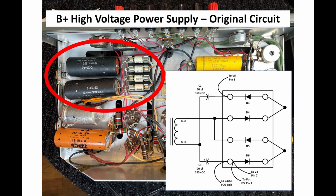just to make sure that I got it right when I changed everything. As far as the transformer hooking up, it really doesn't make a difference which blue wire you hook up where, because it's an AC signal. It'll still work properly. So, I wasn't too nervous about that. But everything else, we need to get right, especially because we're winding up with 600 volts at the end. So, any screw up here could be a nasty explosion.